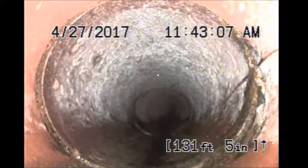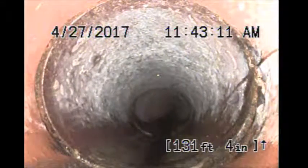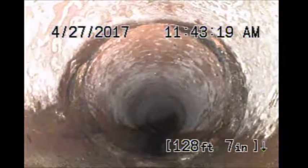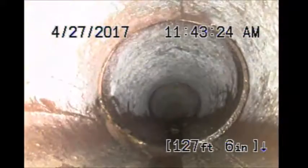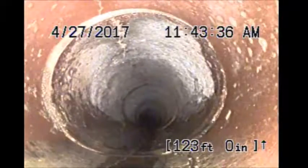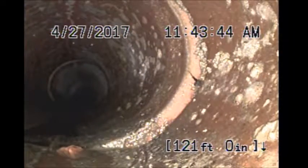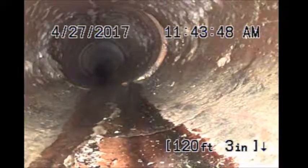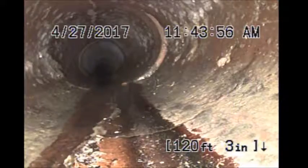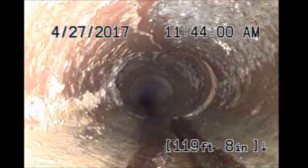Might be another crack in it there about 9 o'clock. You can see it more on the... not sure on that one. Could just be a dark line. Another crack at the top of that section. Definite crack across the bottom up the right side. Pipe almost looks slightly oval in areas.